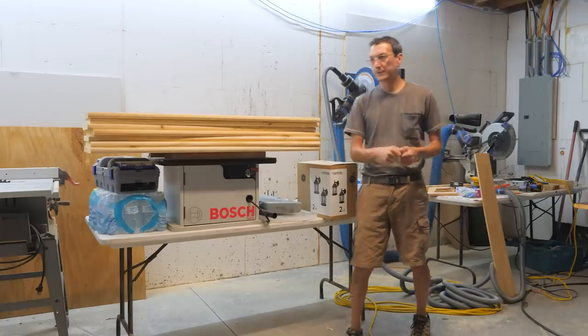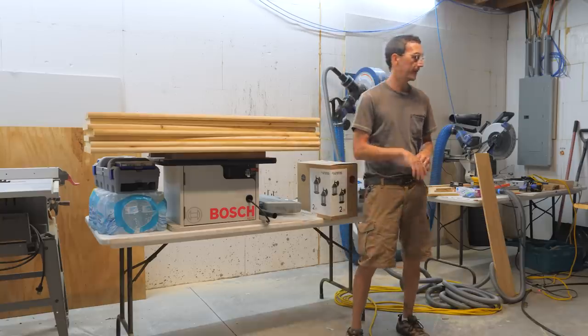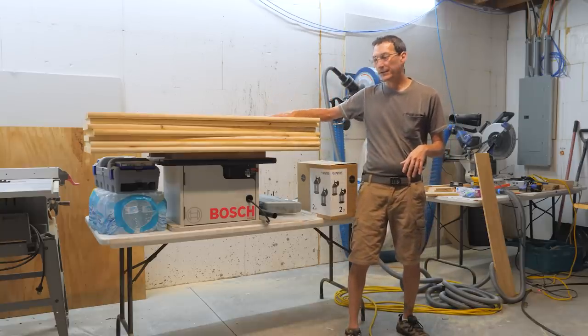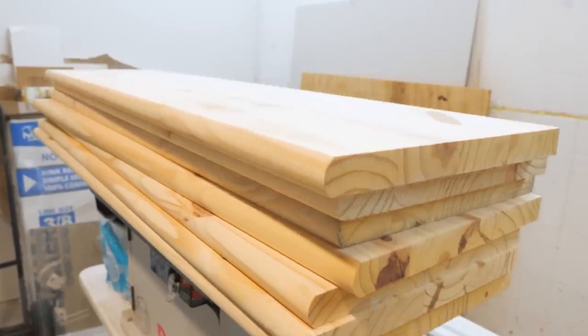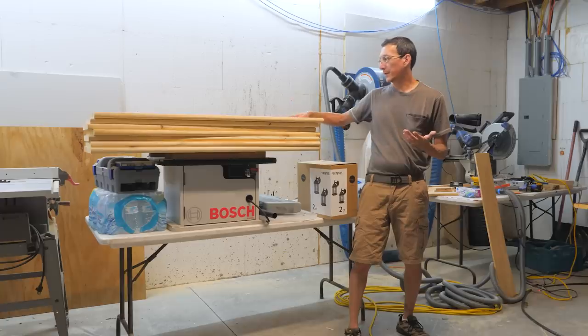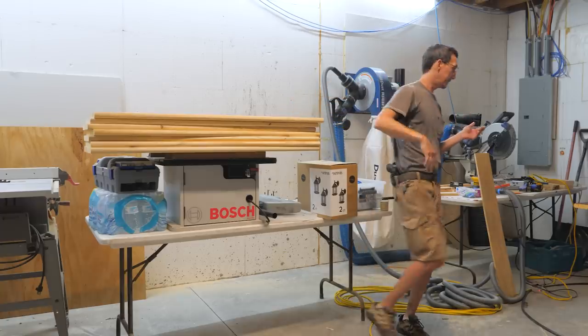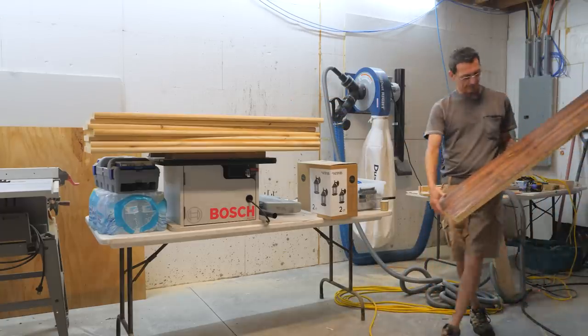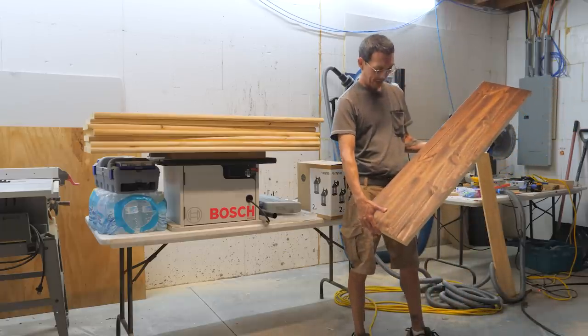I put in permanent risers, which I'll show you in a second. We're going to paint those the same color as the wall, and then I got just the cheapest pine paint grade treads I could get at Lowe's. They already have the bull nose on the front, so they're going to work just fine. And I'm actually going to stain them. I've been staining them to match our doors, and they're turning out surprisingly okay.